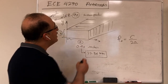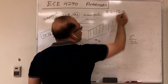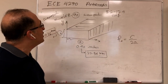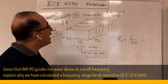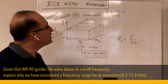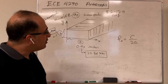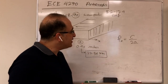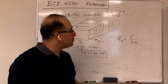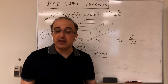For optimal operation, waveguides are rated for specific bands. This WR90 is designed for 8.2 to 12.4 GHz. In this lab we're going to operate it at 10 GHz, which is almost the center frequency of the WR90 band. You'll see more details about the cutoff frequency in the student manual.